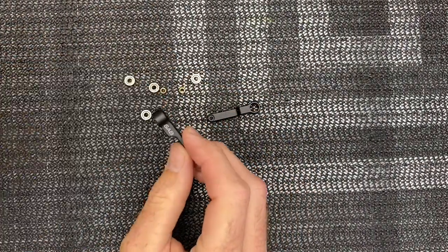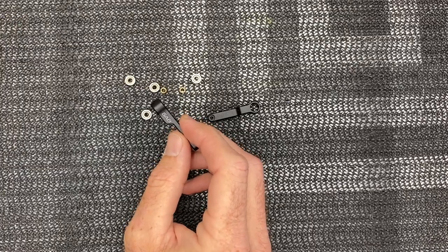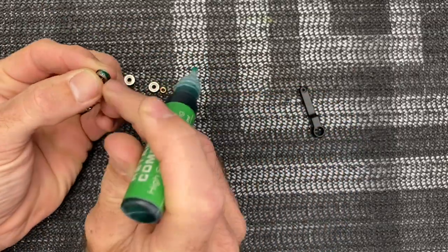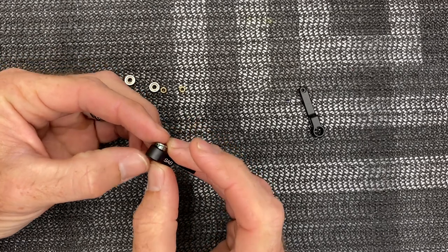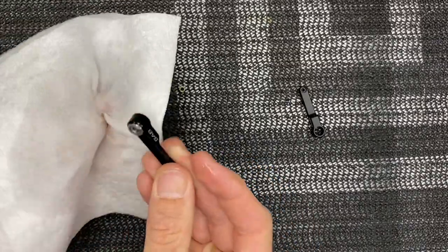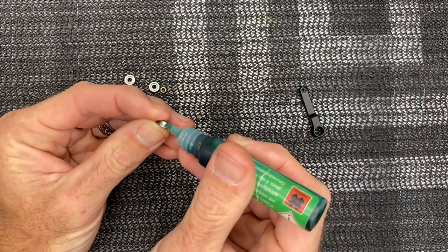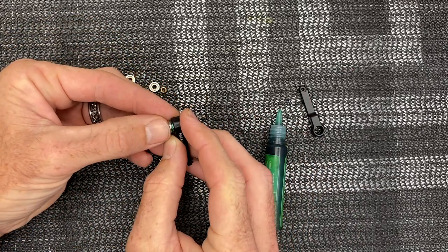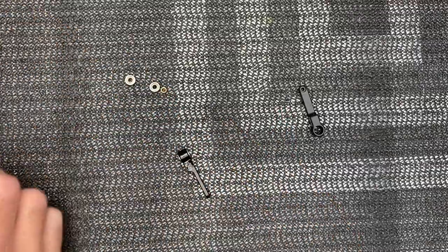Push the whole thing together. Grab radius arms — all three O-rings and dampeners are installed in the head block. Grab retaining compound and the radius arm — do one at a time. Put a gentle bead of retaining compound around the flanged bearing, then simply push the flanged bearing into the arm — it'll snap into place. Clean off with a little rubbing alcohol. Drop the little spacer down in there, then do a bead of retaining compound on the next flanged bearing, slide it in, wipe off excess. Do the exact same on the other one.